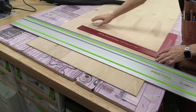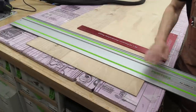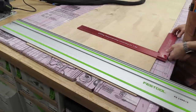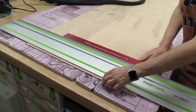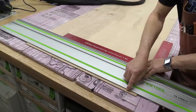Now I've got the panel with two parallel edges. I need to cut a perpendicular edge — this is going to be a cross cut. I'll take my track and get it about where I think is square, then take a framing square, put it up against my track, push that against it to get it nice and square, and go ahead and make this cut.